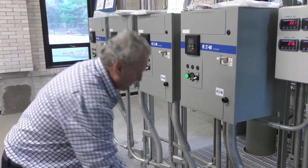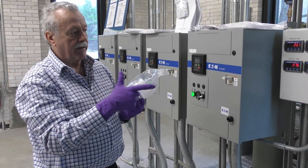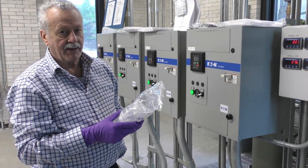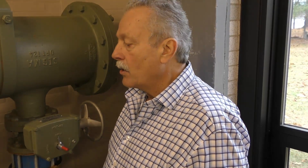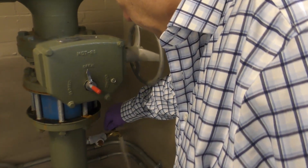That completes the field reagent blank. Now we are going to take the duplicate or triplicate sample bottles from the samples after they are running for five minutes. We are going to turn on all sites and make sure they are running for five minutes before we sample. We call up the public water supply and make sure the wells are running because we want to get a representative sample. The wells are supposed to be running for a period of time so that when we get here they will be representative of the actual depth of the well, and we are going to run each one of these samples for five minutes before we take the large sample.